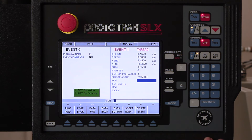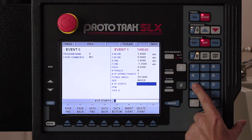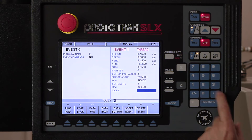It's asking me if I'm cutting inside or outside threads — one is for inside. For number of starts, it'll do multi-lead threads up to 10 leads in a thread. We only need one; it's a standard thread. My RPM I'm just gonna set at 300. And then I'm gonna use tool number five.